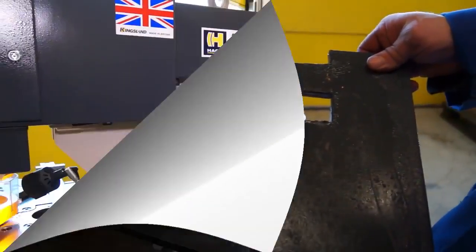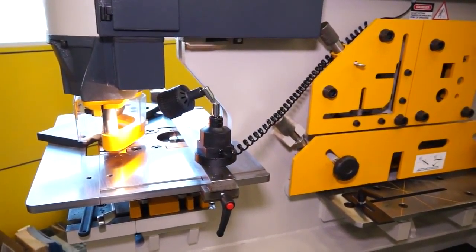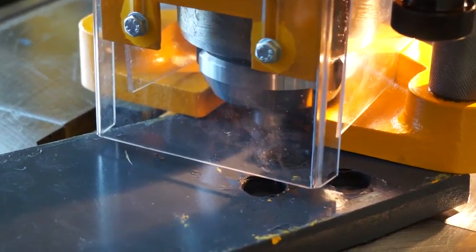From an operation perspective, would you have more than one person on this machine? That's possible — not necessary, but a possibility. And what is the key benefit — why would somebody buy this machine? So that they can save having three or four different machines and have all in one place? Well, it's a cheaper way of doing things because you need only one pump, you need only one reservoir — so technically it's cheaper to combine two machines in one. Secondly, this is very often bought by people who are not in high production but need all the tools. If you're in a building yard or on a ship, you want to have all the tools available, not necessarily to run day and night, but when you want to crop, you want to have it available.